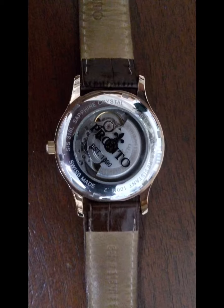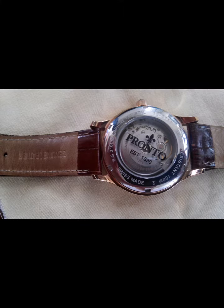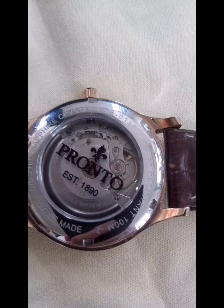Before I do the adjustment, you see I need to do some measurement first. I mark down the accuracy of the watch on the calendar each day. The measurement came out to about plus 14 seconds per day. It is not too bad, but still.